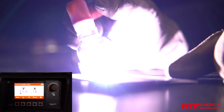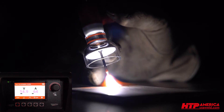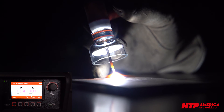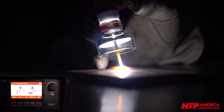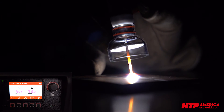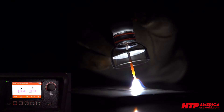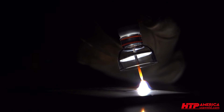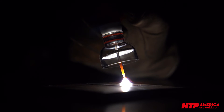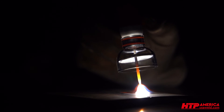I'm touching the tungsten. Lift — there's my arc. As you can tell right here, there is no melting going on. As I go closer, everything melts real nice and I can weld at a fast pace. I can go up a little bit and weld at a slower pace. Or I can go high enough where there is just no melting whatsoever going on at all. As I go in closer, the puddle forms right away. Puddle stops right there.